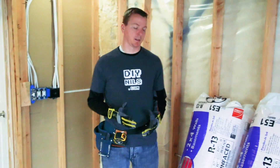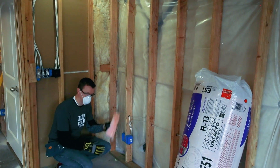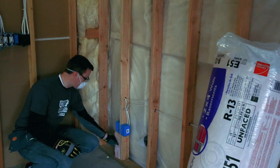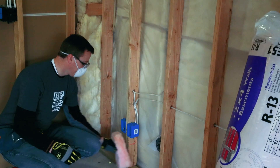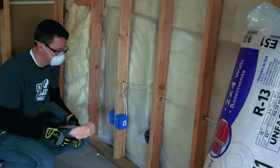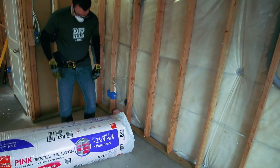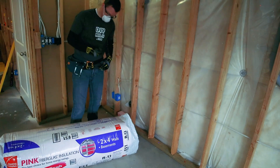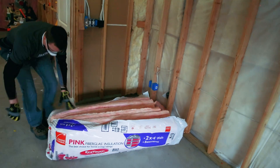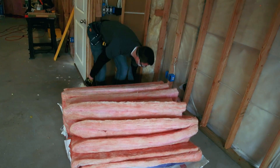With our safety equipment in place and our tools ready, let's go ahead and start insulating. For this first bay, we've got an outlet box right here. A little trick I like to use is to cut a small piece of insulation — or tape or a stick — at the same measurement you're going to want underneath the box. If you put all your electrical boxes at the same height, you can reuse this one piece. So I'm going to cut open my bag, making sure to cut on the sides rather than across the face of the insulation.